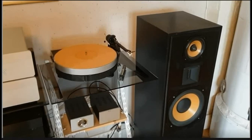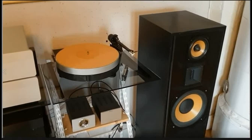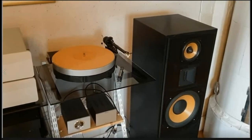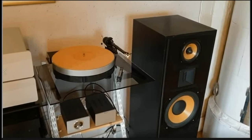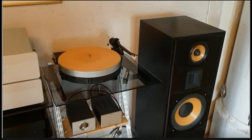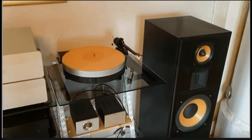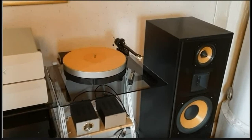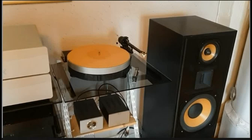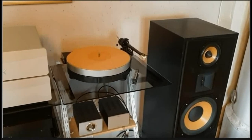Last but not least, the speakers. I'm using a pair of Focal C800 which I built approximately 15 years ago out of a kit, and during 2019 I renovated them. The upgrades consisted of new components to the crossover boards: I substituted the old electrolytic capacitors with new ones from Mundorf, the sugar-lump style resistors were substituted by Mundorf resistors, and I also substituted a film capacitor with a new one from Janssen. I also substituted the internal cables and installed ribbon tweeters from Monacore, model RBT-1000. All joints are soldered. On the rear I installed proper binding posts, so bi-wiring is not a problem and I can really take advantage of the monoblocks.